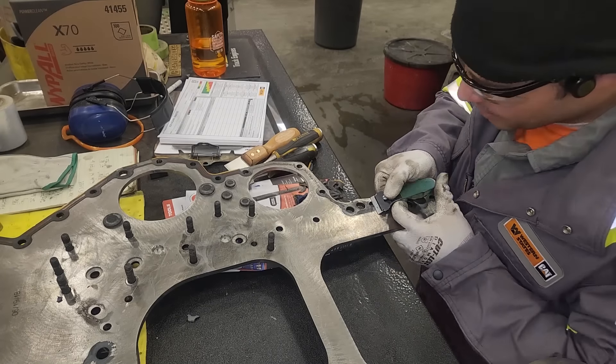I want to scrape it off in the biggest chunks as possible without damaging the underlying material underneath - that takes a little bit of elbow grease. I bought an air scraper at one time - I think it was an Astro Pneumatic air scraper. But to tell you the truth, it was kind of aggressive and it would actually dig into and damage whatever you were trying to scrape off. Now, these are the pass-through studs I was talking about. Those three do not have seals, these ones do. I've actually taken these out, resealed them, and pounded the new seals in. It's a seal washer - kind of like an AC system seal where it's a washer with an embedded piece of rubber in it.